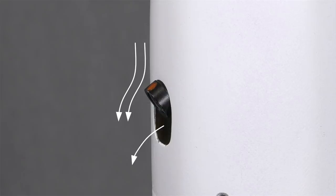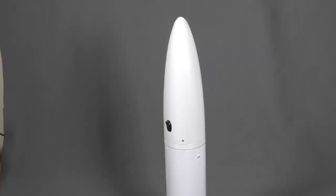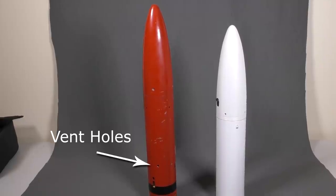I've read several forum posts where people discuss mounting barometric altimeters in nose cones and reporting quite noisy data during the boost phase, which settles down again during the slower coast phase. The final altitude reading isn't affected because the pressure equalises at the slower speeds near apogee. Normally it is recommended that vent holes be located well below the shoulder of the nose cone on the cylindrical part of the payload bay — and this is in fact how we have it on Dark Shadow, which doesn't show these spikes. The altimeter is also located further down on Dark Shadow.